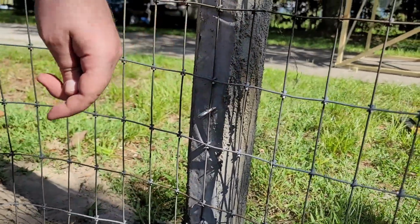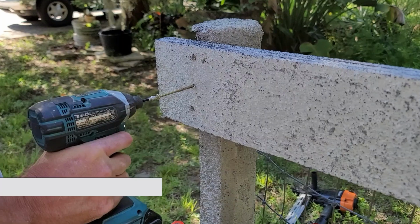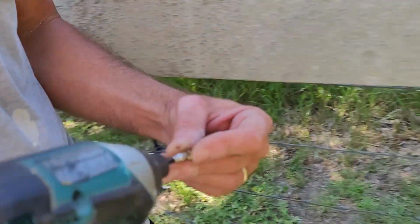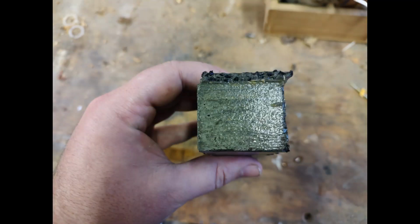The concrete actually ended up being a little bit better than the wood control we were using in experiments. For example, the concrete holds smooth shank nails up to 25% better, has a design strength 13% better due to failing in a ductile manner, and has 41% less deflection than spruce. These figures allow this concrete to function as a direct replacement for wood.